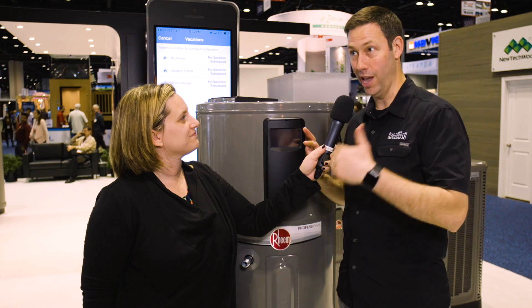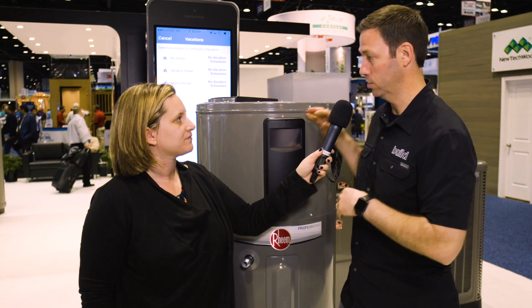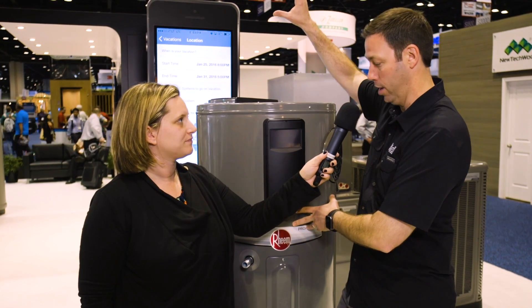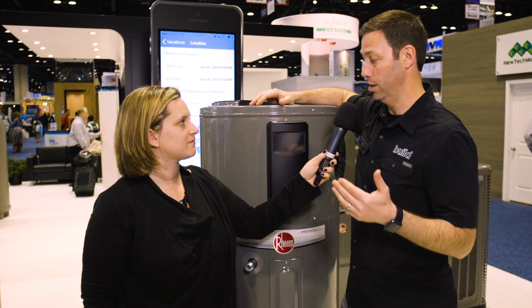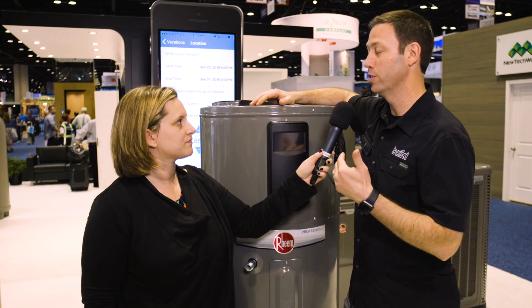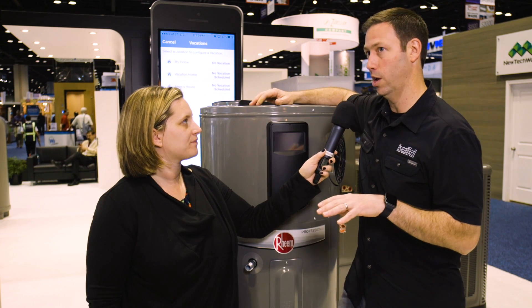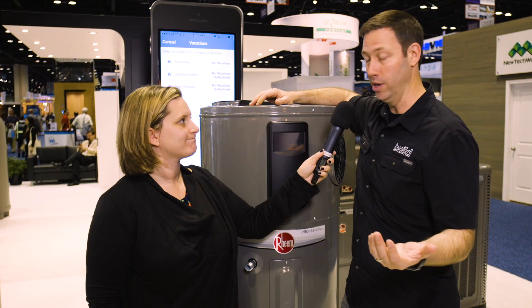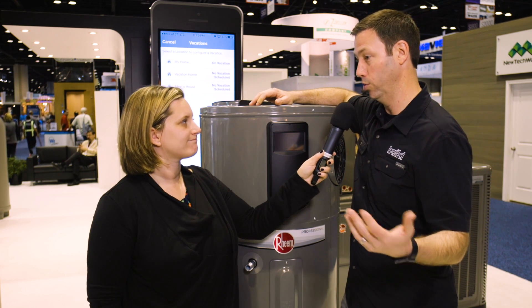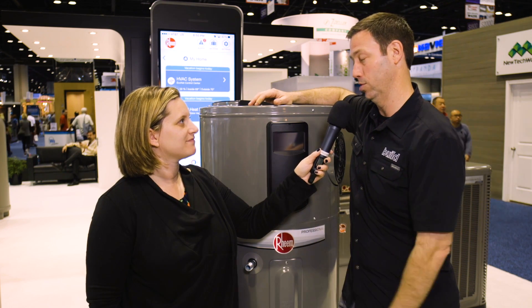I like geeking out on this. These guys came out with a hybrid tank-style 50-gallon water heater. By hybrid, we mean it's got a heat pump up here that's actually taking heat out of the air and dumping it into the tank. They came out with this in 2009, and this year they've unveiled version 4 — interesting timing because one of the units I've used in the past, that manufacturer's out of business. Another big name we all know in the water heating world, GE, they don't even sell them anymore. So it's interesting timing, and this one has some killer features.